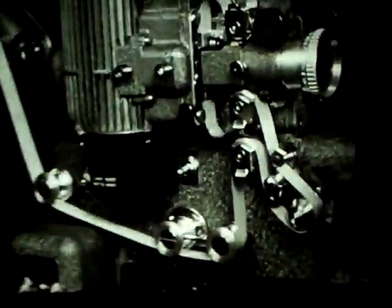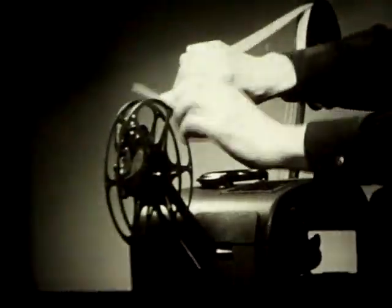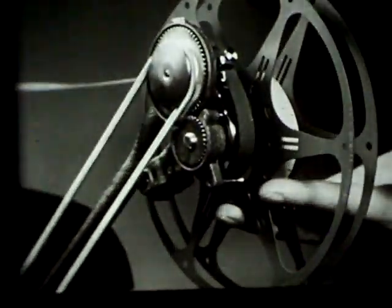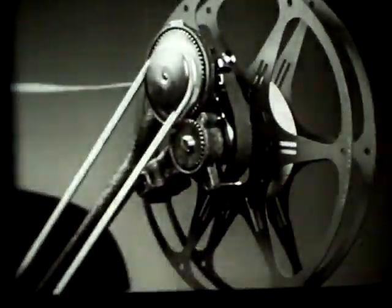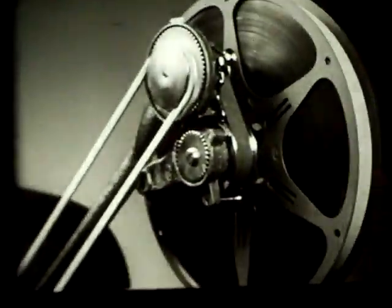Allow the trailer at the end of every sound or silent film to run completely through the machine onto the take-off reel. If the film is to be rewound, first interchange the reels. Then the end of the film is led back over the top of the full reel and fastened to the empty reel. Next, the take-off lock lever is pressed and the reel lifted and held until the lever is released. Actual rewinding can now begin. Check the direction switch to make sure it is set in forward position and snap on the projector switch. Run the motor until all of the film has been wound back on the original reel. Pressing the take-off lock lever drops the mechanism back into take-off position, ready for the next showing.